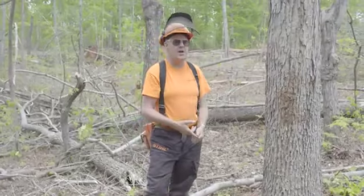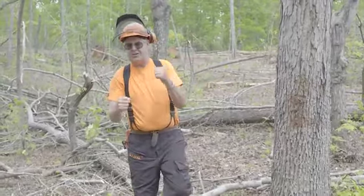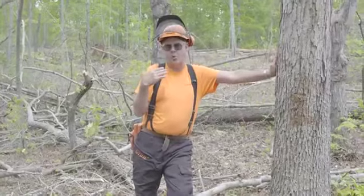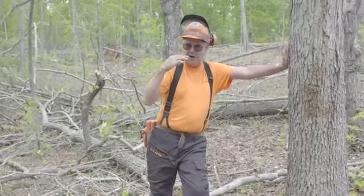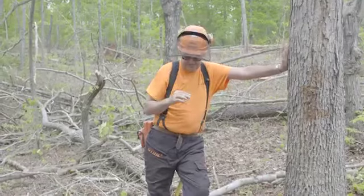Yellow pine and sweet gum are two examples of long-natured fiber that is flexible, okay? So in other words, I'm not going to put 2 inches of wood on a 20-inch sweet gum. I don't need it because that fiber is very stringy. I can get away with less hinge thickness.